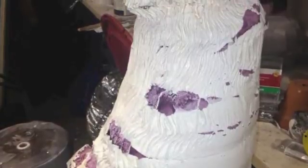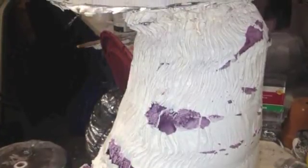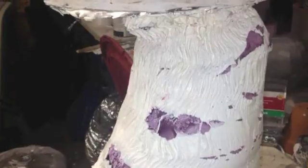The heat issue — we think we have resolved it. Here you'll see one run with heat at about 350°C and what happened to that stack of foam. We coated it with a ceramic paint, which helped, but we still had to move off of the foam. We moved into a fiberboard — a fiberglass fiberboard.